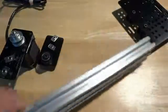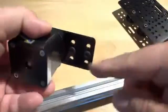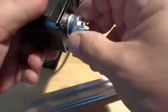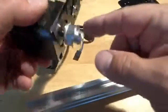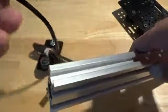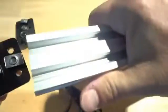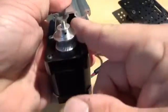Alright, so take this off for 1 second. We have that set. I'm going to take my motor. Now you can see it's kind of reversed the way I put the screws through here, 8mm screws with some T-nuts, and I have my GT2 30 tooth timing pulley. It's bigger, and the idea is that it allows it to run through the channel and above the rail itself. So slide this on here. I have these in the middle holes too, something like that. You can see how one side will be able to go through the tunnel, the other side will be able to travel on top.